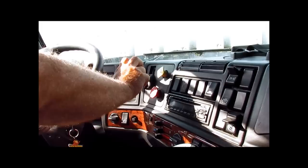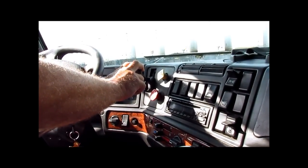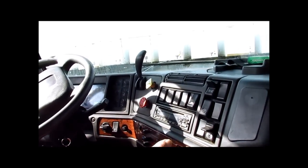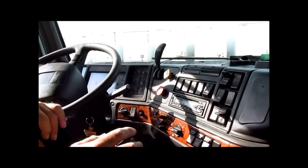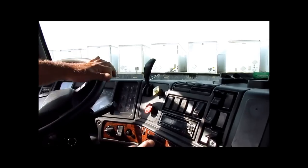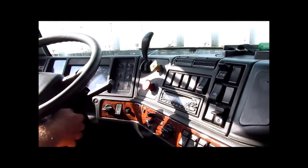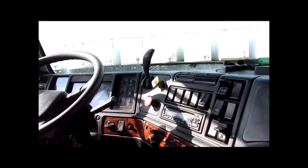Pull down the trailer spike. Another little tug. Release the spike. Drive ahead ten feet. Step on the foot brake. Back up ten feet. Apply the foot brake again. Neutral. Parking brake. Shut the truck off. That now completes our air brake.